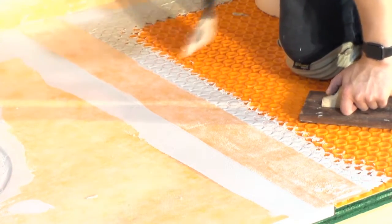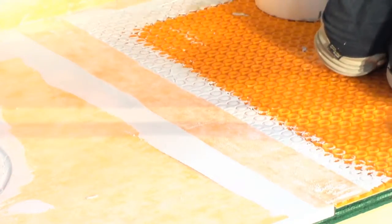And if you did all the seams on the entire floor and did a floor-to-wall connection like we showed you here around the perimeter of your bathroom, you could turn the whole bathroom floor in essence into a big shower pan. So keep that in mind, that you could actually create that and protect that OSB from ever seeing any water at all. So there you go, folks.